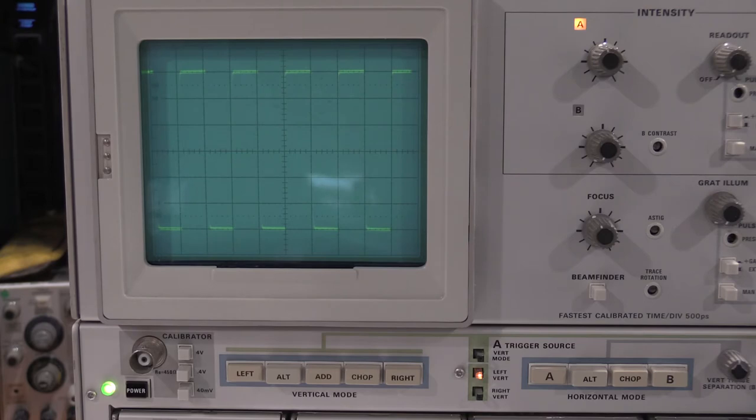And it's a good thing I did, because on channel 1, the gain adjustment and the 2x gain adjustment were out. So this is the tail end of the channel 1 gain adjustment. I'm just into checking the vertical deflection, making sure all the attenuators are working exactly like they're supposed to. So I'm going to go through that real quick. I got to do it for channel 1 and channel 2. So there's going to be some repeat stuff in here, but it's just what you got to do to check in one of these things. But yeah, we'll get that going here real quick.